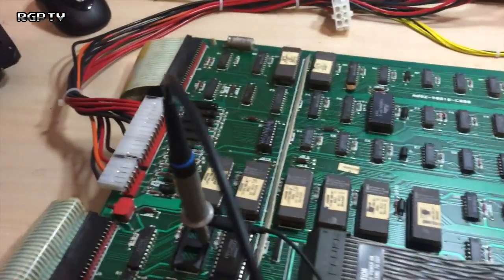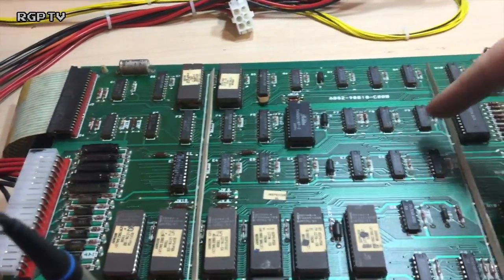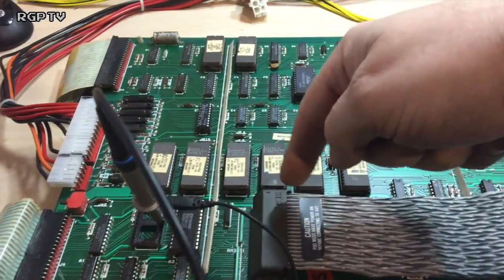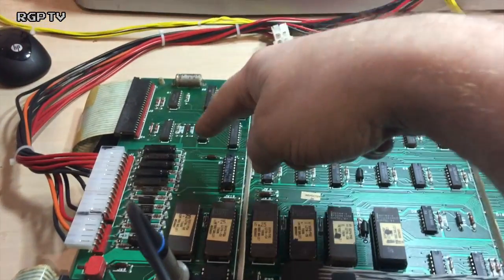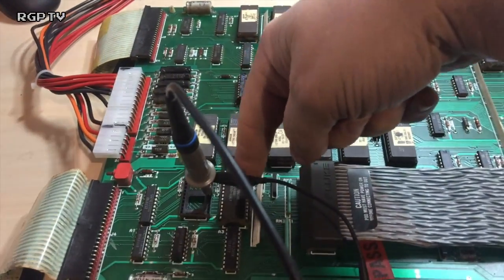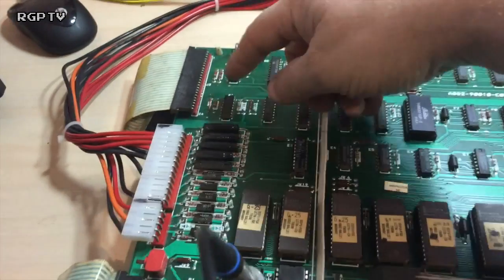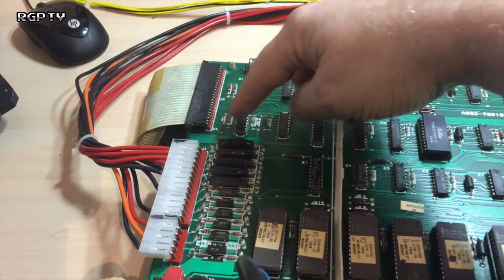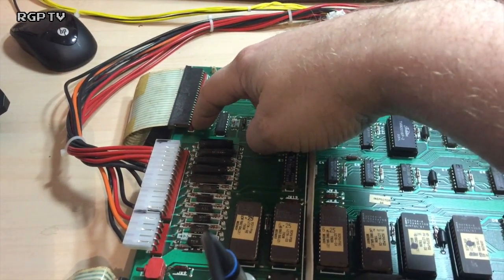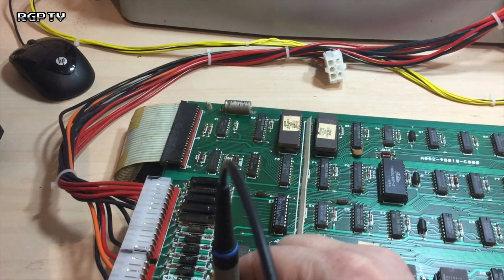So, what was wrong? Okay, well, F1 here leaves and comes all the way over somewhere underneath this chip, and I kind of lose it, and it works its way back down here somewhere. But at the same time, it also heads up this chip, the CS RAM signal here heads itself all the way up to the start of this wire link. And there was no bridge in there, but there was something hanging out, like a jumper wire, or what had been a jump wire at some point, sat there. So I've remade that connection.